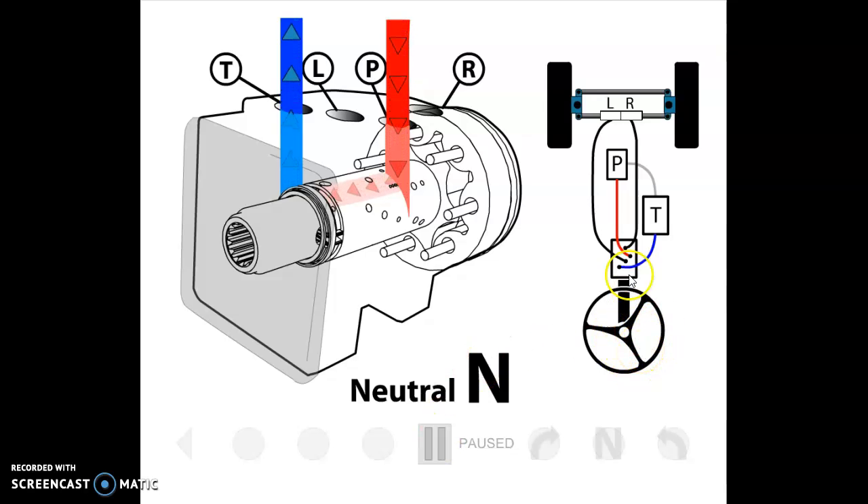The steering wheel also doesn't have a straight-ahead position. If you keep cranking the wheel, eventually you'll hit a dead end of the balance cylinder — steered all the way left or all the way right. At that point, if the operator steers aggressively, oil will be pumped over the relief valves — not shown in this animation, but visible in the schematic. You can crank oil over the relief valves with the steering wheel turned 180 degrees and then stop steering and recenter it. If you have a John Deere or Caterpillar logo on the horn button, you might find the logo is upside down when traveling straight ahead, because there's no reference point — the steering wheel just turns the spool and sleeve.